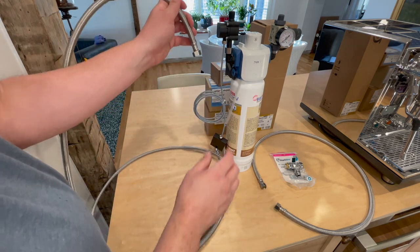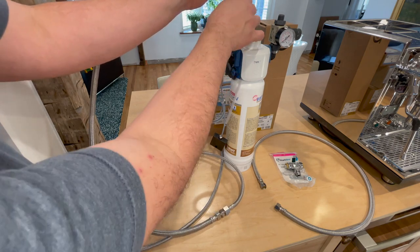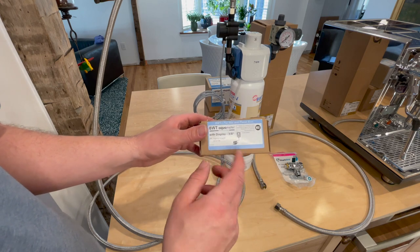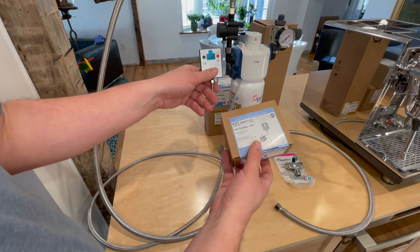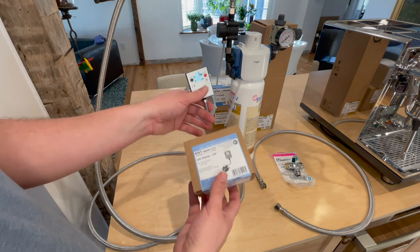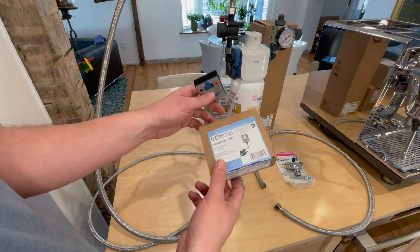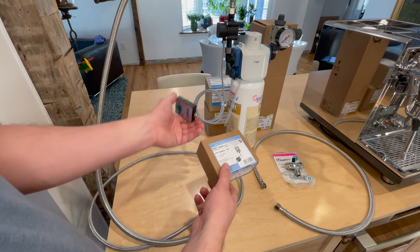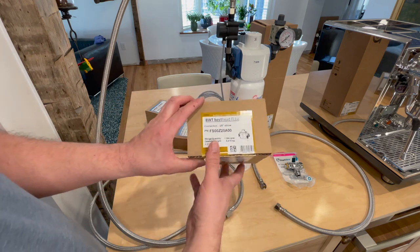The other end of the braided stainless steel service line fits nicely into the top of my BWT system. I'm running it backwards from the machine here. This is the BWT Aqua Meter display - it's a system to track how many liters of water have flowed through the filter so you can determine how much life is left. They say to replace the filters every year, though you can go more off usage since the filter media doesn't really go bad.